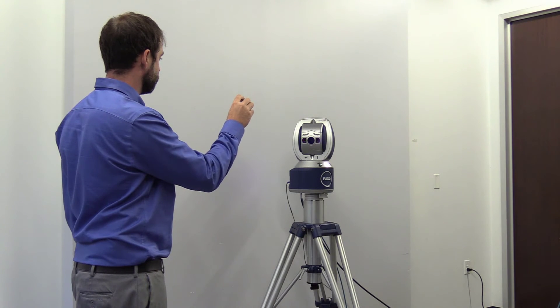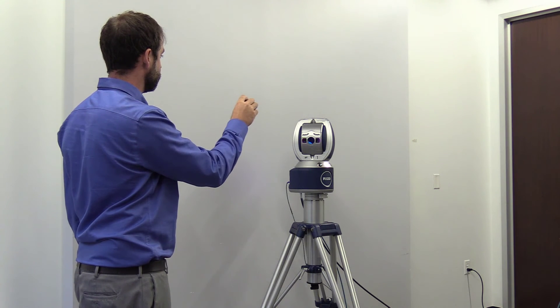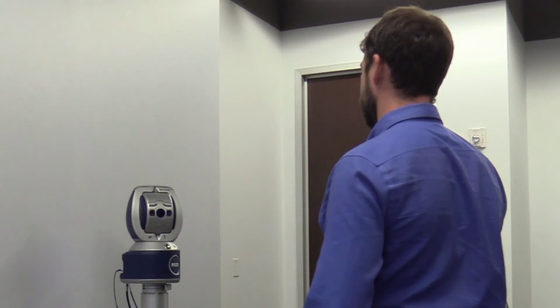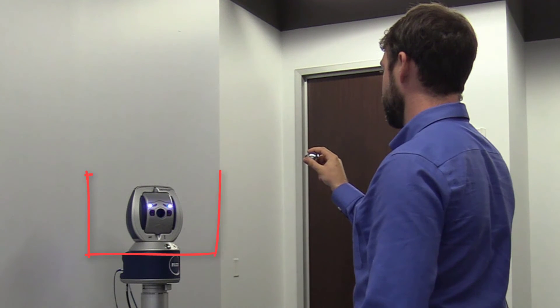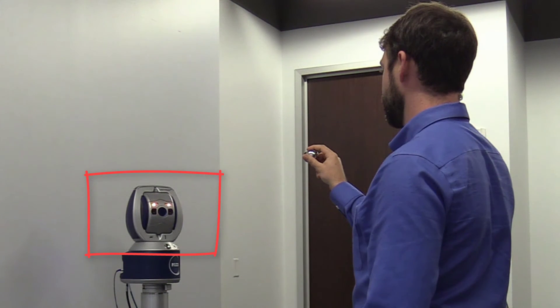A popular feature improved with greater frame rate and a wider field of view is gestures. For the tracker to acquire an SMR at a distance from the tracker, wave the SMR left to right, right to left, and left to right for a total of three passes in front of the tracker. The cameras will pick up the motion and the tracker lights will turn blue to show initiation, then yellow as it attempts to connect. Finally, the tracker will turn green when the SMR is located and a successful connection has been made.